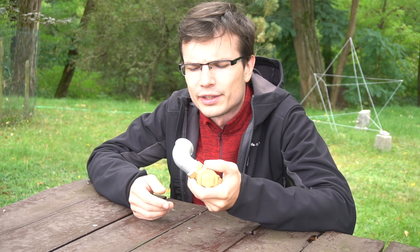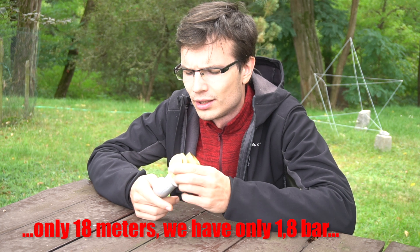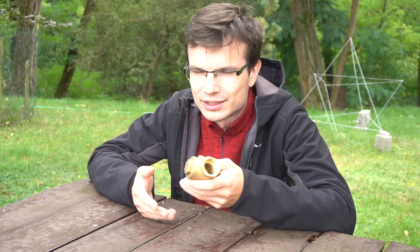As you can see, this valve is quite fast. It doesn't have so much pressure — you can pump water with it probably to 20-21 meters because we have 2.1 bars. And why is this so? Because we don't have so much weight in this flap. With this swing check valve the water flow isn't sufficient, it's incredibly slow, because it doesn't have pressure so it also doesn't have water flow. There is no weight so it reacts to the water instantly, so no pressure can build up. I don't recommend this one — first of all it doesn't have any pressure and also it's not so durable.